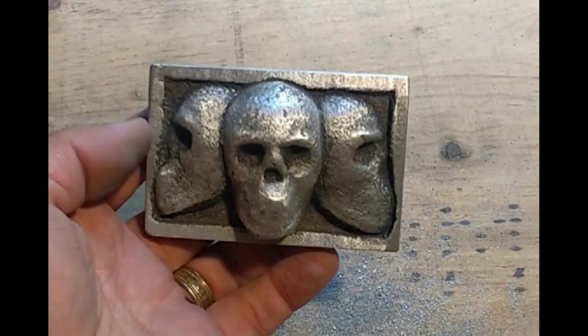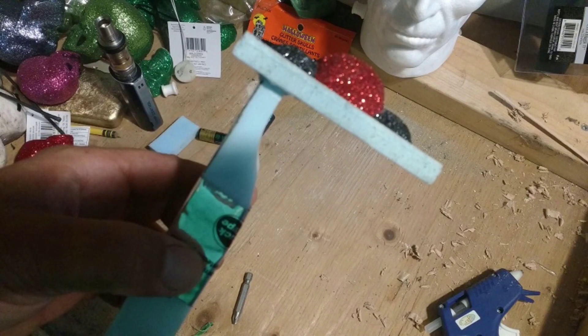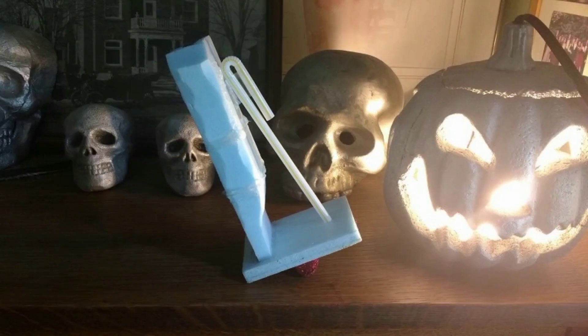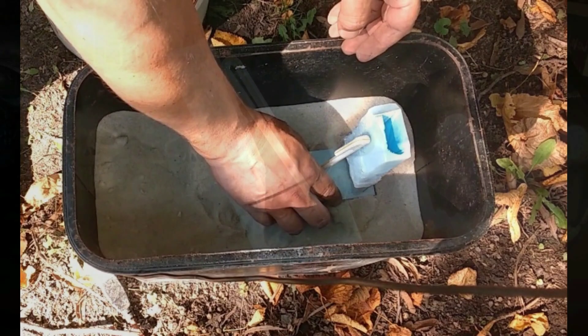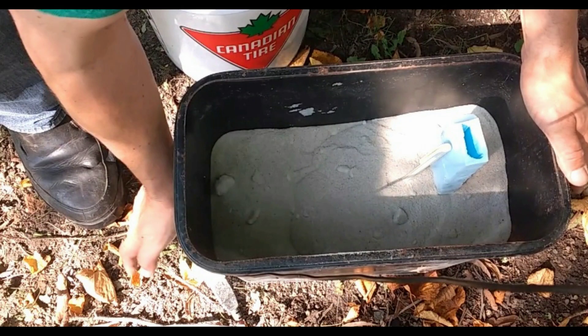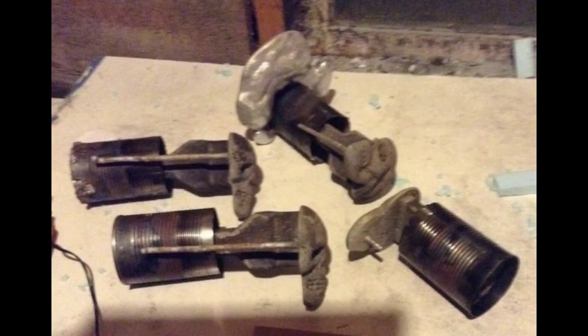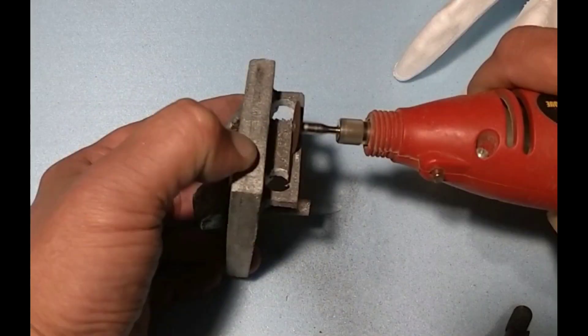You can see I used a hollow sprue and that I was casting the belt loop as a solid piece of metal at the time for most of these others, but this time I actually cut the loop out of the foam itself, which left less gating for the metal to get into the part through, but it actually worked out pretty well in the end.